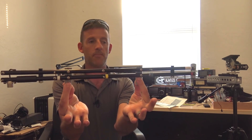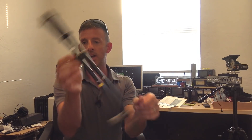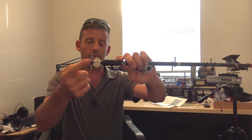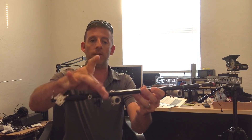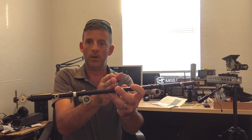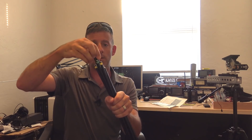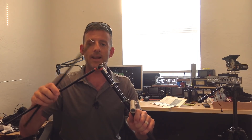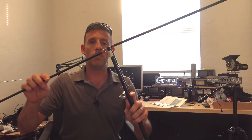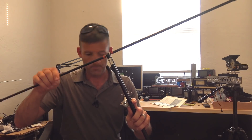Here's the boom, and it looks like the boom also has the color bands on it, so I'm going to guess without opening the manual that that's where I screw on the elements — those colors. And then this is going to be the mount. The front is going to have the feed point — another difference from a Yagi versus a log periodic, this is going to be fed at the front. Essentially all the elements are active. Let's put this together. We'll take the red ones here and they just screw on — see, another plus on why I wanted this antenna. They simply screw on.